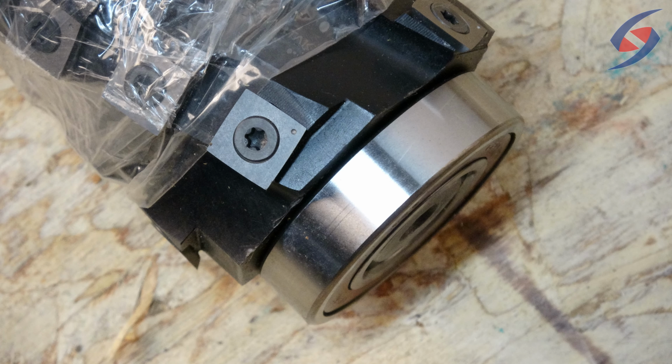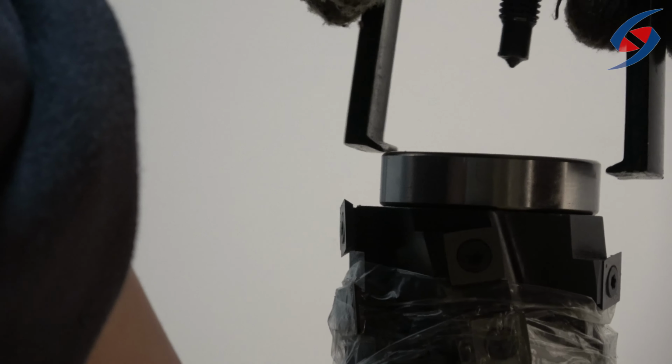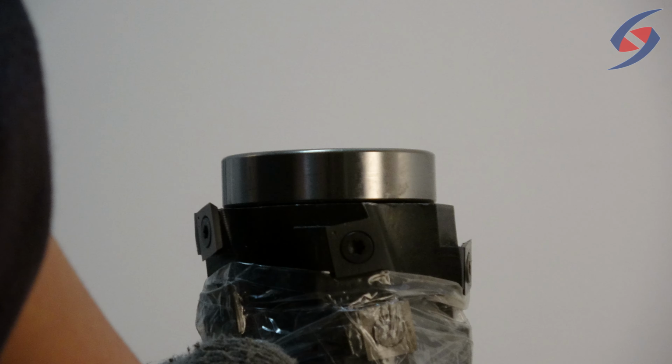In this video, we will discuss the bearing removal process without using bearing pullers. Bearing pullers are ineffective when the arms of the tool don't have enough grip under the bearing to pull it out. This happens when the bearing is sitting too close to the shaft or there is no room for the bearing puller to fit. They might also not work when the bearing is fitted on too tightly and there is insufficient force to remove the bearing.